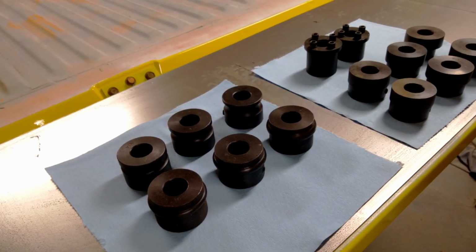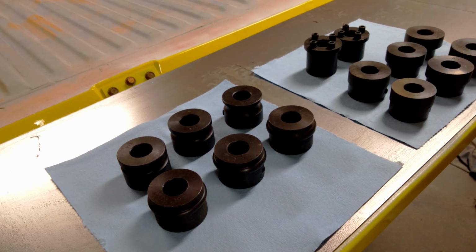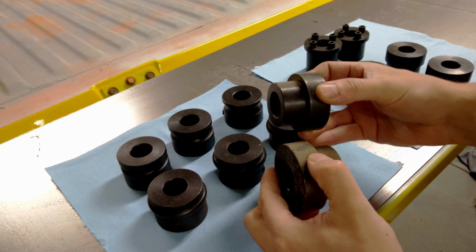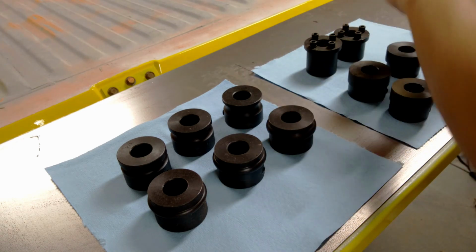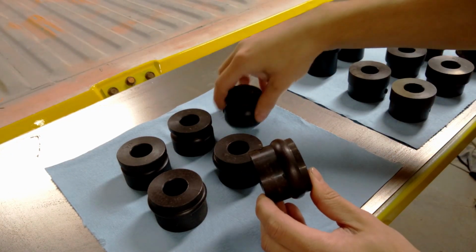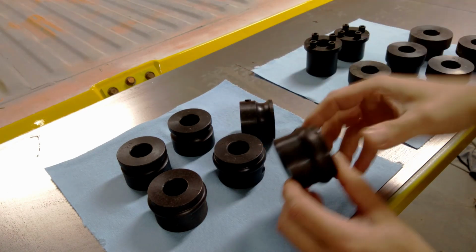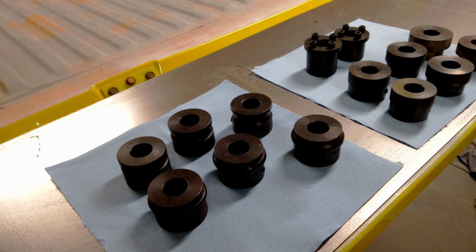These are all the dies that came with my bead roller. There's a decent selection here. It'd be nice to have a nice tipping die, but whatever. So these are the 2 that I was using, and you can set this distance as well as this distance to make pretty much any bevel you would like. But I'm not going to use those. I'm going to use some of these. So I'm probably going to use this one because it'll be the simplest. This should get me a nice bead on this panel. So I'm going to pop these on and adjust the bead roller.